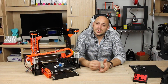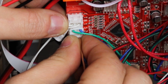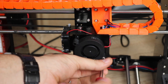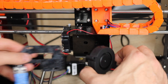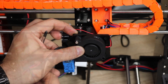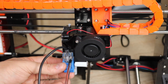Once the wires are switched, simply take out the Z limit switch connector and replace it with the bed level connector. Installing this particular sensor is very easy — you simply undo the two screws holding the part cooling fan together. You do have to replace them with a slightly larger pair of screws, or they will not reach the threads due to the added acrylic thickness. Once you switch them, simply screw them back in.